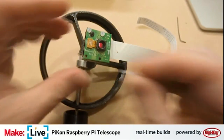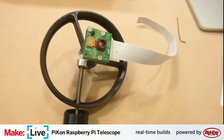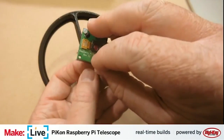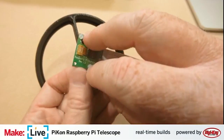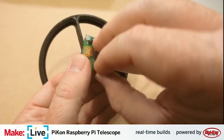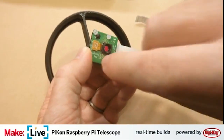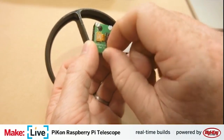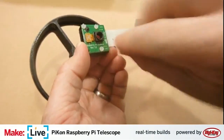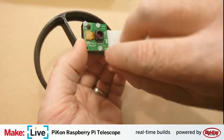I was going to say that maybe it's just my experience with it, but I also feel like the overall quality of PLA has been generally improving, and it's losing its reputation for being quite so brittle of a material. Well, there's a lot of additives being added in to try to combat that. So we're seeing a lot of variants out there. There's the PLA PHA, the high temp PLAs, the stronger PLAs that people are doing. But yeah, you just need to know the material that you're using.